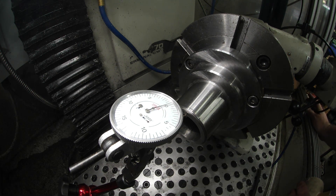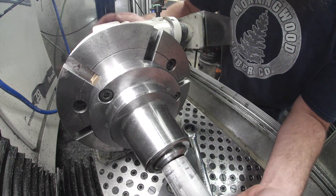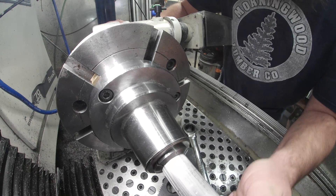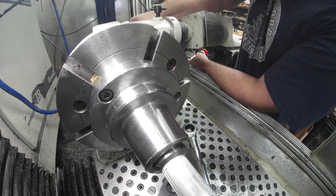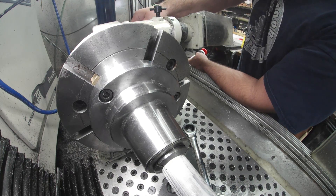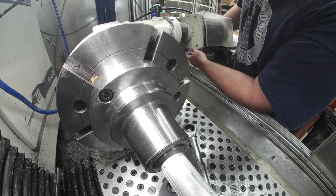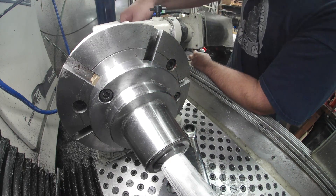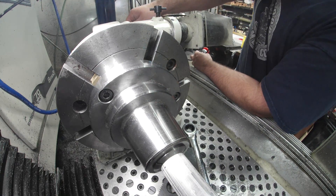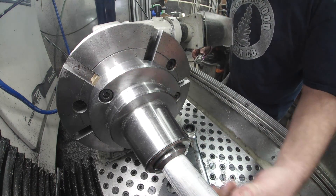A few more days from now I should have all the parts in to wire this up for automated die changing. We've got the bar stock in here and we'll do a test. We don't have the right solenoid yet, so I've got to swap air lines. I've got a three-way two-position, not a five-way two-position. Now it locks down and doesn't move. Now I'll swap it — I've got to swap lines with a hose. Now it comes out.